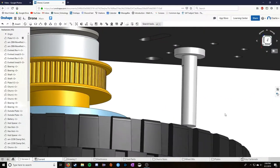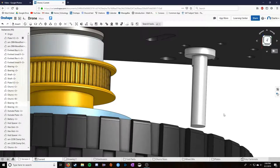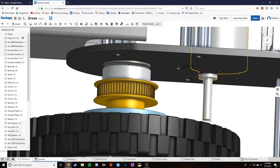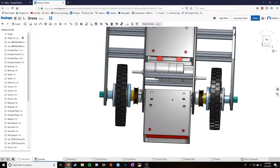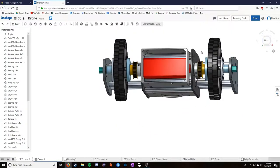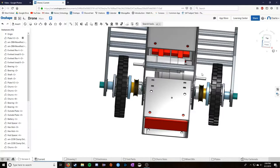I didn't need to design it in because designing pulleys isn't really that important on the end of a motor, you see. So once again, there's nothing holding on the end of the motor, right? But because the motor is just a pulley, which drives out to here, and this is held securely, there's no excess torque on this shaft, which will avoid breaking the motor.